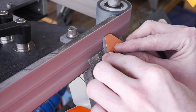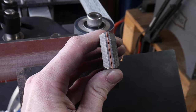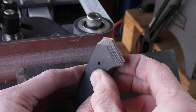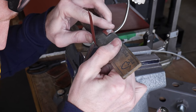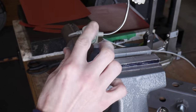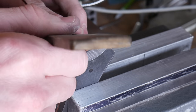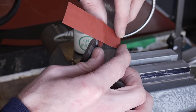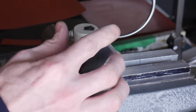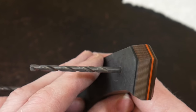To give the knife a more tactical feel, instead of a rounded front handle scale design I went a little angular with a point in the front of the handle scales — I feel this gives a nice aggressive look. I got the scales up to a 220 grit finish on the belt sander, then cleaned them up with 300 and 600 grit at the hand sanding bench, making sure to use a backing block when cleaning up the angles so as not to wash out the crisp lines. Out of all the handle materials I use, I really like G10 — it grinds well and finishes nicely. One drawback is it's fairly heavy, but it's pretty bulletproof.